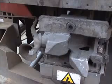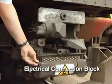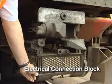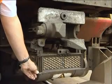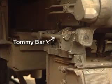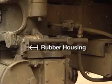We'll look at how to do this later in the program. At the bottom is the electrical connection block with its rotating cover, under which are 103 electrical connecting pins — 50 fixed and 53 spring-loaded. At each side of the coupler there are horizontal tommy bars for retracting the electrical connection block. They must be seated in the rubber housings.